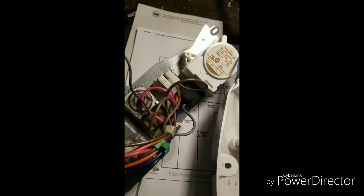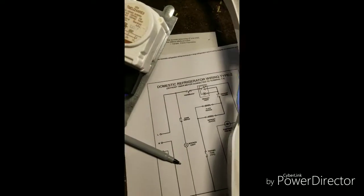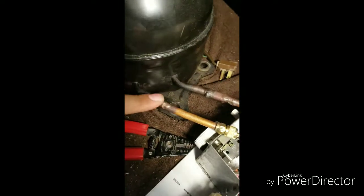This is another working set from a scrap refrigerator that has a thermostat, a switch, and a defrost timer. I also have a compressor I took from a refrigerator that had a major leak — so the compressor itself is working. This is an R134a compressor, and this is what I'm planning to install. I put some connections on it and I'll just solder that into the other refrigerator. It has working terminals.